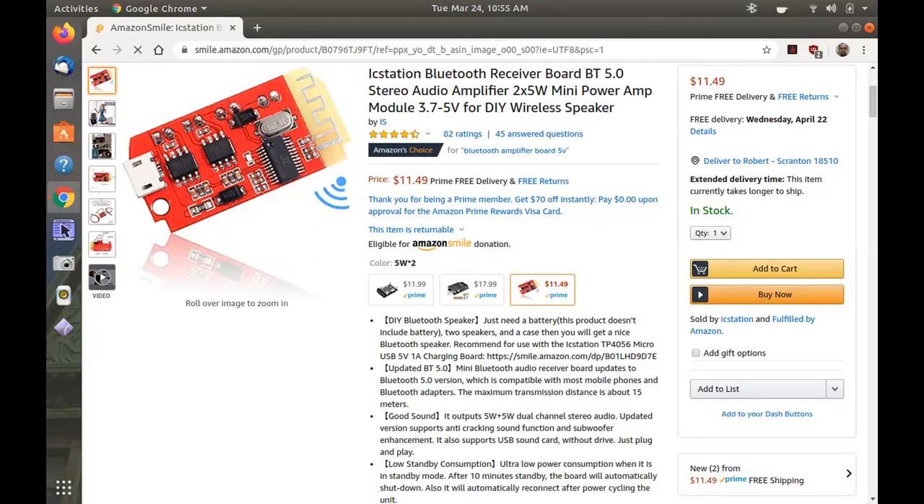As you can hear, it sounds really good — nice frequency response. I can't hear the really high tones anymore, but it sounded just as good as playing it off my stereo. It's only 20 millimeters by 40 millimeters, so you can build it into a very small package. With the low power consumption, you could even use one of the little flat pack lithium batteries with it if you didn't want to use an 18650.